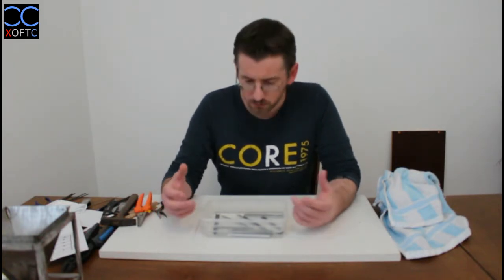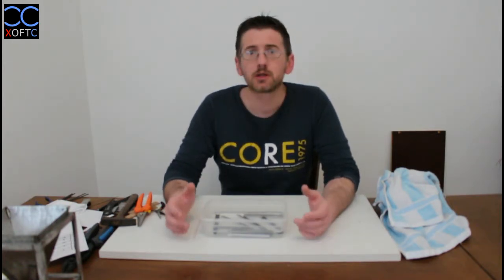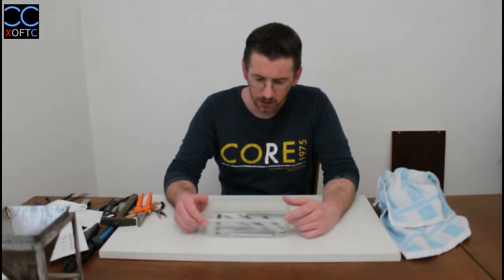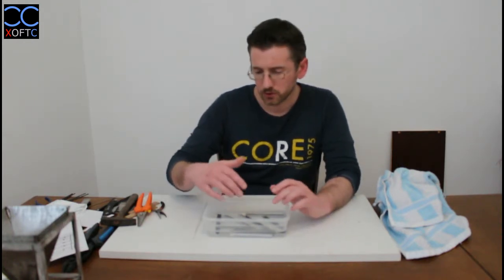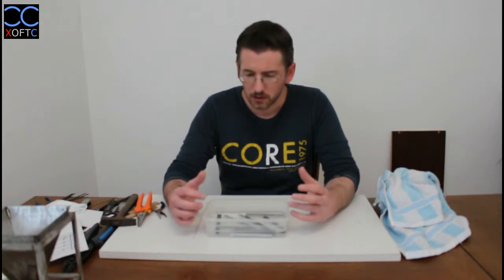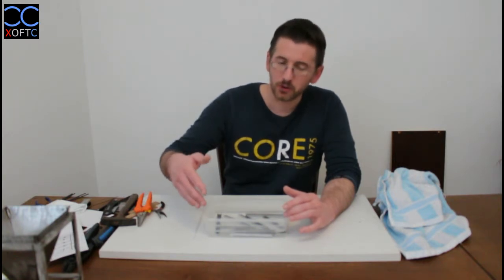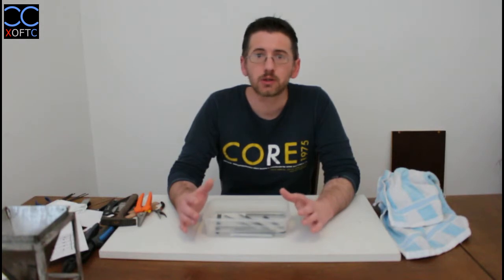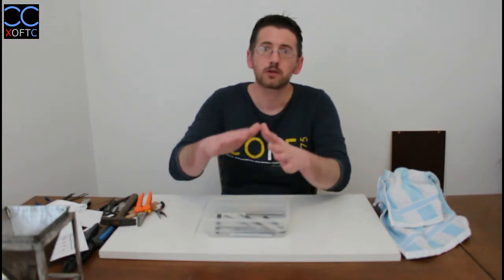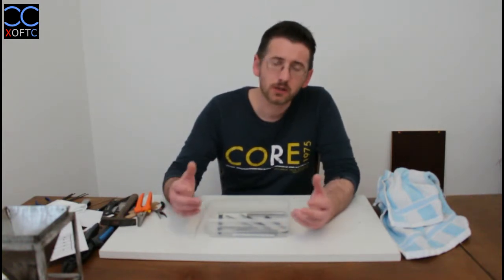I'm going to just talk for a minute about shaping these parts. As I said, I really try to keep these tutorials short, and I'm cutting a lot of the talking in between, because it would make the whole thing too long. When you're bending the material, when you're shaping it, you always want to allow the metal to do what it needs to do. You create a mark, and that's the fault line in the metal. That's where it's supposed to bend, but you don't want to overdo it. You just apply pressure and allow the metal to figure out that it needs to bend there. You will see that when you're working.